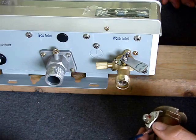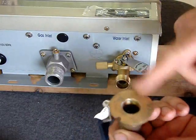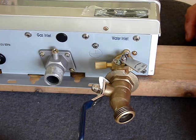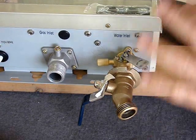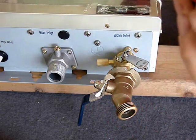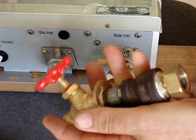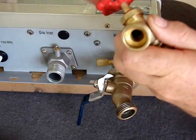If you are going to run your heater off of garden hoses — say at a campsite — you can use something like this garden hose fitting. I like these because you can have the garden hose running from your main spigot at a campsite, which might be quite a distance from where you're actually camped. You can leave it on there and then turn off your flow here, and then your heater will shut down. You can have the hot exit on the other side of the heater going out for filling your campsite bucket for washing dishes, for your shower, or whatever. The modifications and combinations are infinite. This would be a garden hose type setup controlling water flow coming in, and of course the ability to turn it on and off on the hot side. Thank you for watching our video.